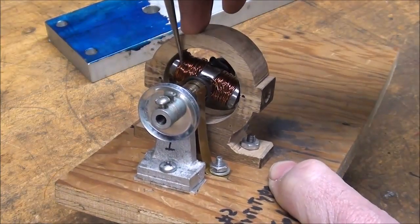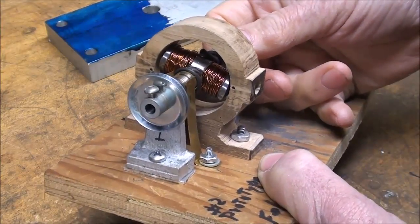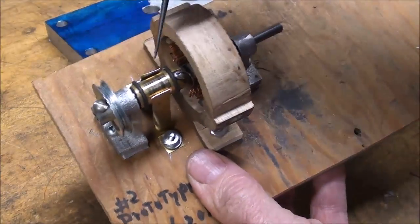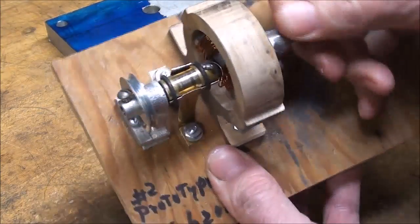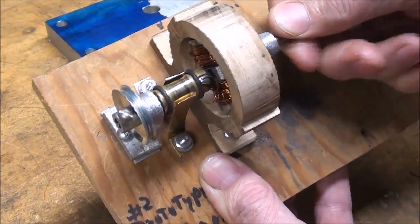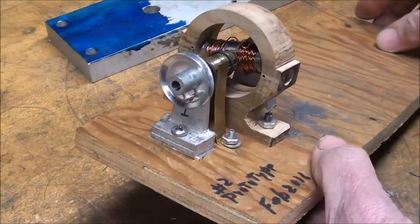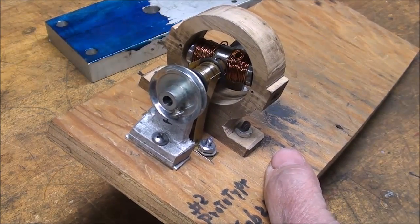This of course is the rotor — rotor meaning rotating, moving — and in this case it is the armature. This is a commutator type, and a commutator — this is just a two-piece commutator — is nothing more than a moving or rotating switch with brushes acting upon it, either delivering or picking up the current. I hope I got that terminology correct; I am not an expert on electricity or motors. I am a machinist, founderman, and model maker at best.